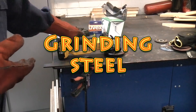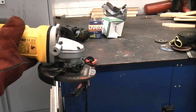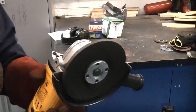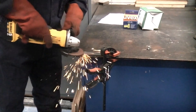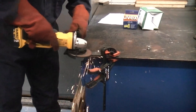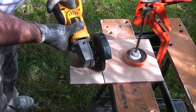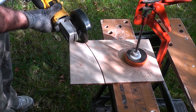Normally when you're using a grinding disc, the actual disc needs to be at an angle of between 10 and 30 degrees. One thing you should never do with a disc like that is try grinding on the edge — they are not designed for that. They are designed to grind at between 10 and 30 degrees. If you use a diamond tile cutting blade you can actually cut out some really difficult patterns in tiles. In this example I'm actually cutting out a curve in a tile for around a shower tray.